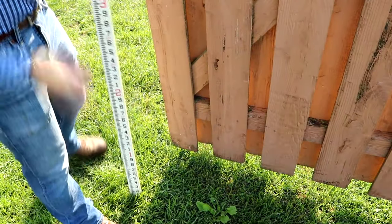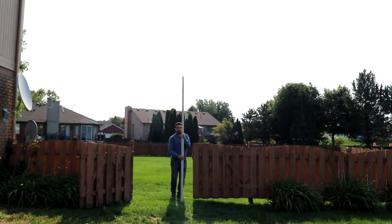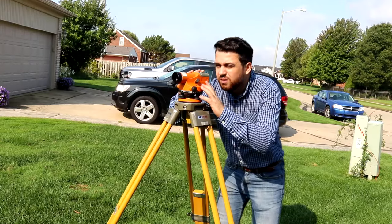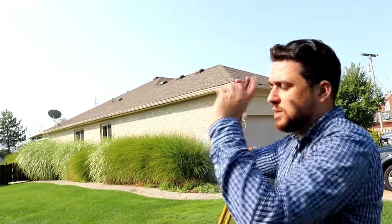We're going to have a turn point right here at the bottom of this gate. I'm going to hold the rod right here and that's where we'll take our turn. Usually there should be a marked point for the turn, but for the sake of this experiment I'm using this location. It looks like we're reading 4.50 — it's between two marks, so I'll round that down to 4.50. Remember, if you're coming in between two numbers, always round down. Chances are the rod is being held slightly off center and you're better off reading the lower number. Now we'll pick up and go to the next setup.